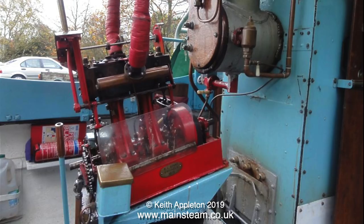Here's a close-up of the engine when it was in the boat. The piece of plastic on the side of the engine is just a splash guard to stop the oil from going everywhere, and the tank nearest the camera is the oil tank that supplies oil to the bearings. This is where the problem with the engine started - at some stage some foreign bodies got into the oil tank and blocked one of the oilways to the front bearing.